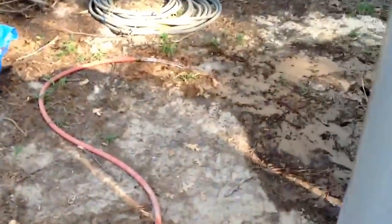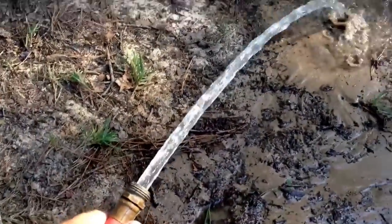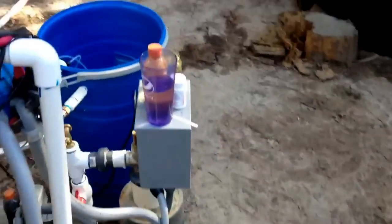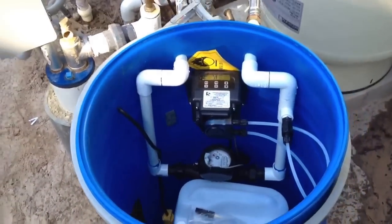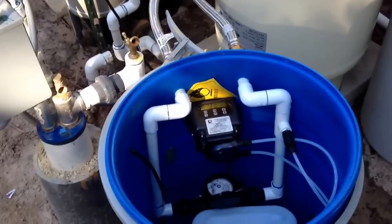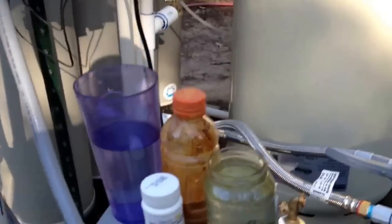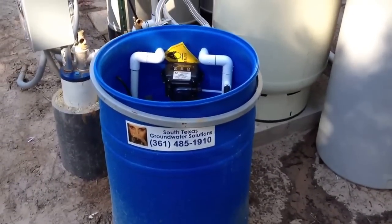The peroxide needs to be replaced about every 64,000 gallons or so, depending on your usage — roughly about every 64,000 gallons or one year. You can hear it injecting right now. I'm turning the water off here. It only injects as needed; the meter communicates with the pump and it only injects when there's a flow. Iron — lots of iron. If you have any questions, leave me a comment. Thank you.